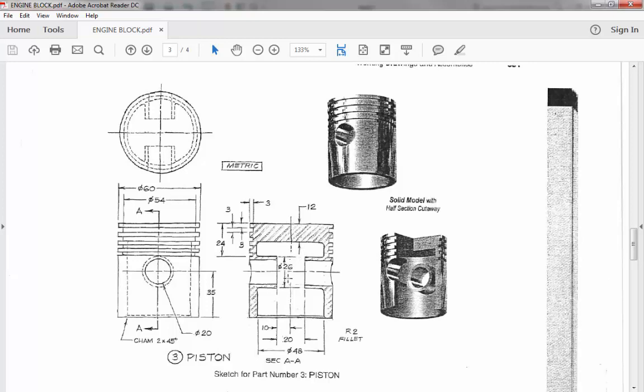At the end, then go back in here and create a plane down the middle of it, draw you a circle in the middle, 2 circles, and then extrude the bigger circle out to the surface, and then cut the smaller circle through the entire thing. Okay, so you have to kind of build it in a revolve, create you a circle on the inside plane, these 2 circles, and then extrude, cut them out. Okay.